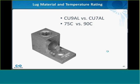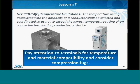And that's important because when you're sizing your conductors, often you'll use a 90 C rated conductor because you get a better current rating by code with a 90 C than a 75 C rated conductor. But the code requires under 110.14(C) that the temperature rating of your conductor has to match the temperature rating of the lowest connection terminal. So if you have a 75C terminal on your output conductor terminal, you might not be able to use the 90C rating of your wire.